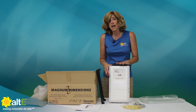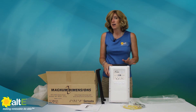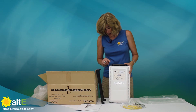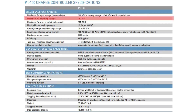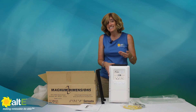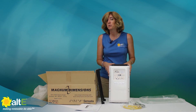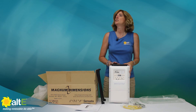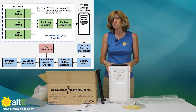It actually has both arc fault and ground fault protection, so you've got a really safe install. A nice thing about it is that many MPPT charge controllers only go up to 150 volt temperature compensated input, but this will actually go up to 187 volts. That lets you put three 24-volt panels in series or four 20-volt panels — more than what you can typically do with a 150-volt charge controller. This really lets you put a nice big solar array of up to 6600 watts into this one charge controller.